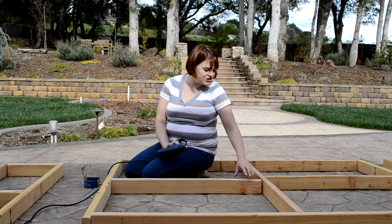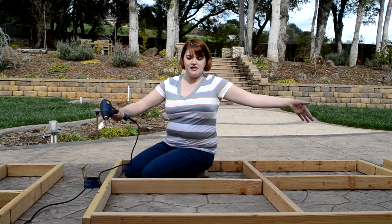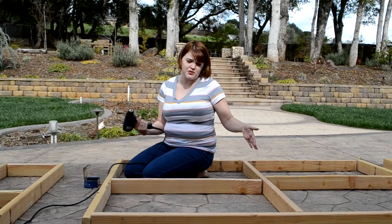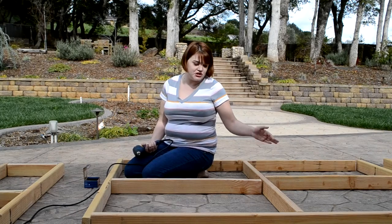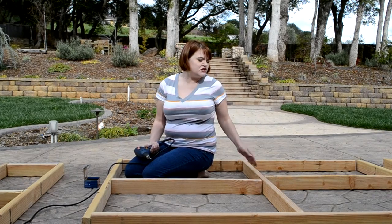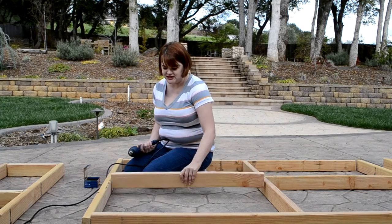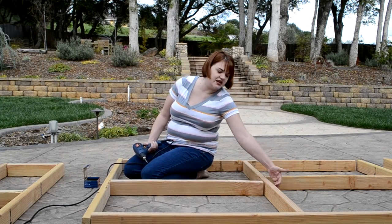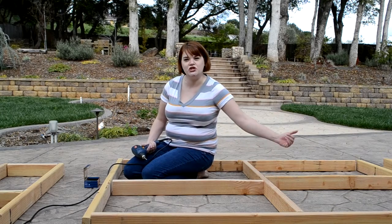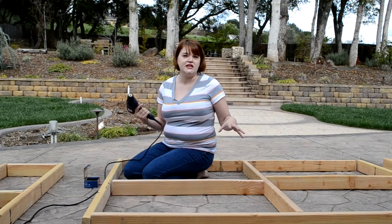I want to pay special attention to this middle part. This is all going to get covered in a giant piece of plywood, but because I'm making this headboard so big, one piece of plywood alone wasn't going to cut it — I'm going to have to have a seam in my plywood. So even if I didn't need it for strength, I would have to have a centerpiece to screw all the plywood into where that seam is. That's why I have it going vertical — so that I can have that seam. With these cross pieces to support it, I'm offsetting them so that I can come in from both sides and screw them in, staggering them so you can get through all the studs. I have a ton of drilling to do, and then once this is all assembled we'll move on to the plywood.